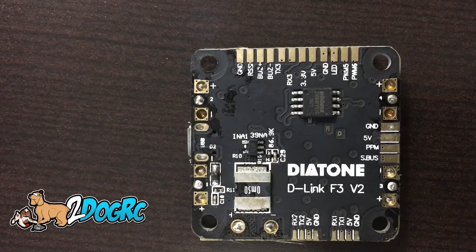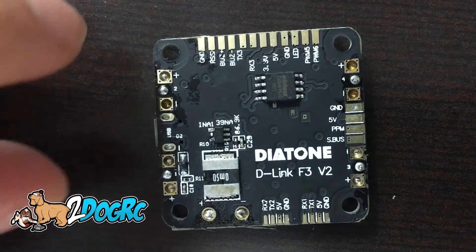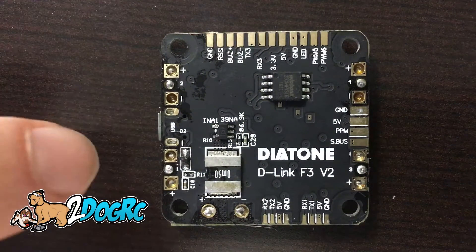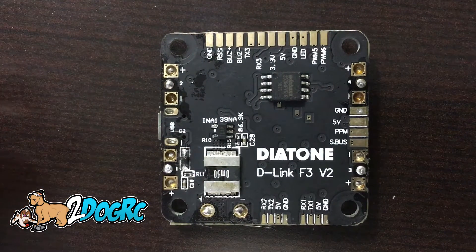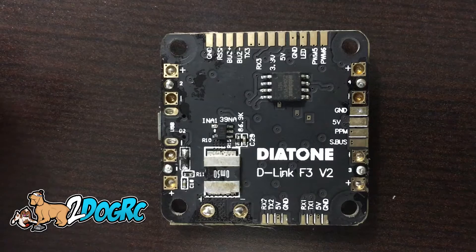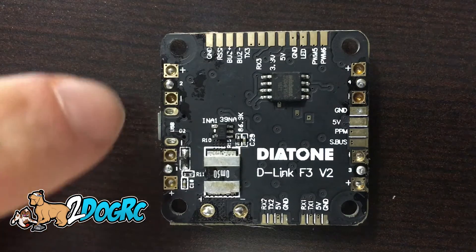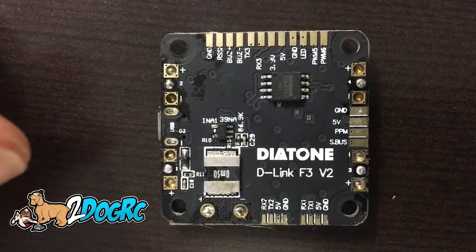I hope that makes sense. I'm traveling — I don't have a wire set with me, but I did bring a board. This is the current sensor now that you have on there. So you can go into the configuration tab, select to turn on current sensor on board, hit save, and then go in your OSD and you can have the milliamps consumed and your current reading displayed.